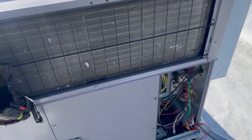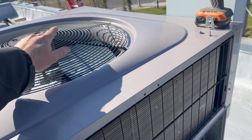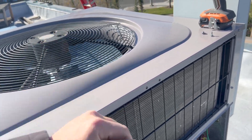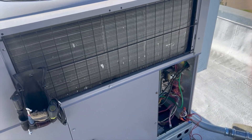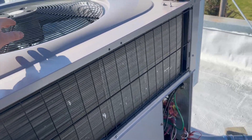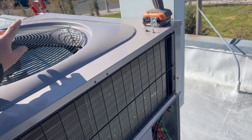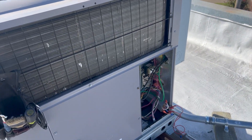She came on — looks like it had a three-minute delay, so that's good. A quick easy way to see if your heat pump's working: feel the air coming out — it should be cold. Yep, it's cold. So the heat pump is running. When running in cool mode, the air coming out of the outdoor unit should be a little warmer than ambient. So far so good.